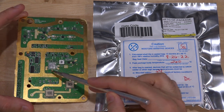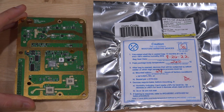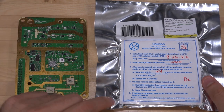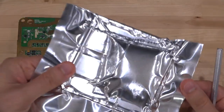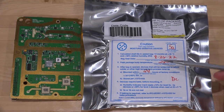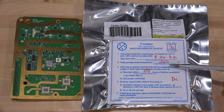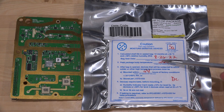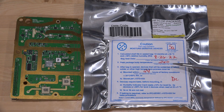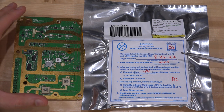That's the part that would go over here. There's a lot to talk about regarding what's actually going on with that. I've already removed it and that wasn't easy at all. You can see from how sophisticated and serious this packaging is that this needs to be handled very carefully. The maximum body temperature of this particular component is 240 or 260 degrees Celsius, which is not very high. So reflowing this whole board or using an air gun to put it on is just not going to happen.